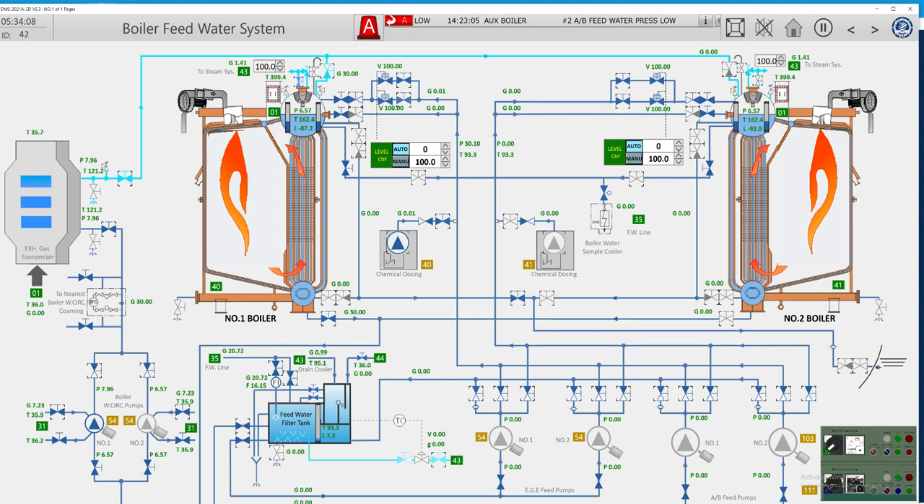Verify that your automatic filling is working properly, or you can use your valve for filling. First of all, after this situation, the best condition is to stop your pump. As the level increases here and goes up inside the tank to the normal level, you will have a positive pressure on your pump suction.